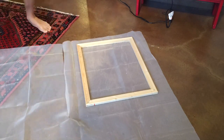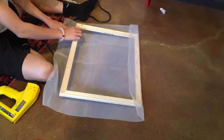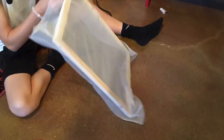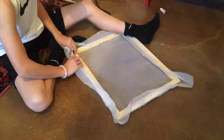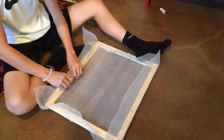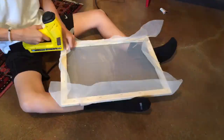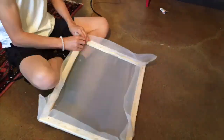For the second step, all you have to do is cut out around two inches of the mesh from the sides of the screen, and then staple the mesh to the screen. Stapling the mesh to the screen is actually kind of a hard process — if you had a specialized tool it would be way easier, but with just your hands and a staple gun, you have to pull the mesh as tight as you can and staple it as fast as you can so you don't lose the tightness.